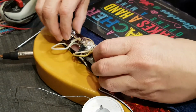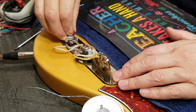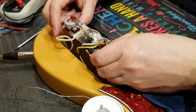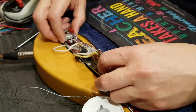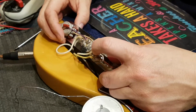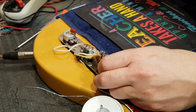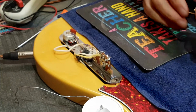And set it up. I'm just going to flip it over this way this time. Those are wired correctly. I'm happy with those. And even my tone circuit, I'm pretty damn sure that it's good. Max tone, resistance way up there, not close to ground. This one here, bring in my resistance closer to ground. That's fine. I'm pretty sure that tone is good. Now, this guy, I need to select probably any one of these two to the center. And it probably needs to be Mr. Neck. Okay. Can do. Assuredly can do.